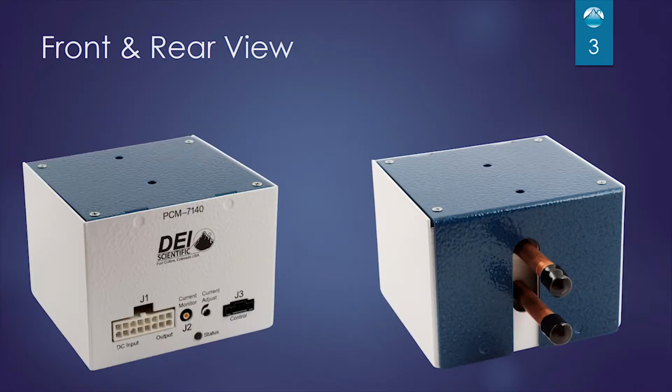Here you see the front and rear view of the module. On the left-hand side you see J1. That's where you put in the high voltage input and the DC output. J3 is the control cable, and J2 is the current monitor. To the right of the current monitor, we have a potentiometer that you can adjust the output current with, and a status LED. On the right-hand side you can see the liquid connections.